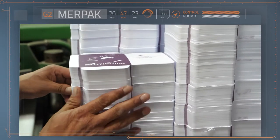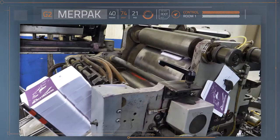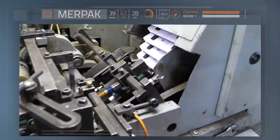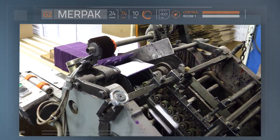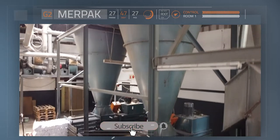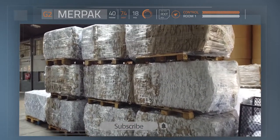The shaped paper pieces are taken to the factory machines where they're folded, glued, and formed into an envelope in one continuous operation. They come out on the other side of the machine as a fully formed envelope. All of the paper offcuts pass through a large machine and are baled and sent off to recyclers to be recycled and reused at a later stage.